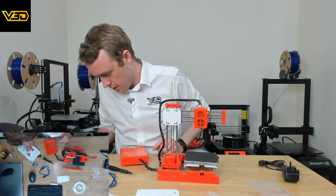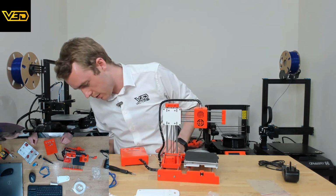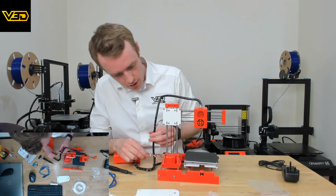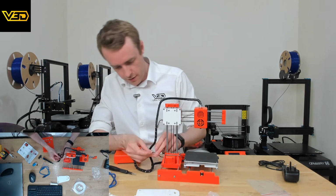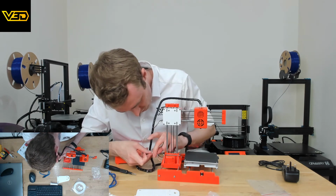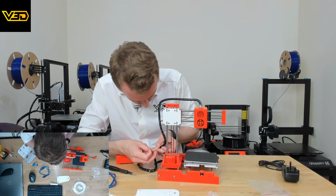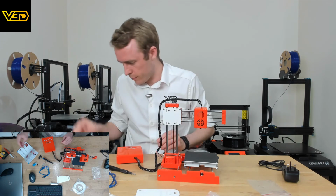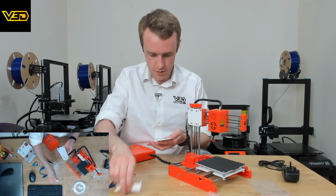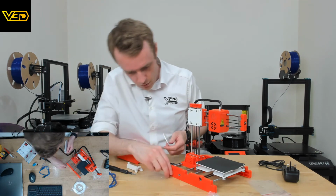Connect the Z-axis motor wire to the black wire of the printer control box as shown in the figure below. So connected to this black wire, which is not black. I mean, it's the only wire. So yeah, this black wire that's grey, connected to that. These are small. Which way around? That looks about right. Install the filament holder. Look at this for a filament holder. Ooh, screws.